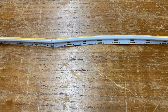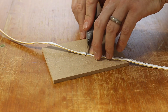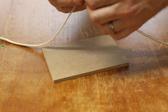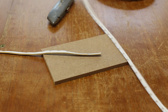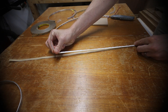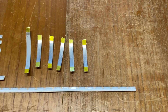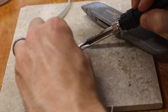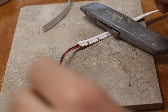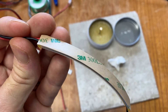There's no adhesive tape on the strip itself, so I ordered the same double-sided tape that LED strips usually use. The strips were then cut up and the tape applied. I got some two millimetre thick aluminium bar, cut it to the right length, and hammer-formed it into the right curve to fit within the central ring. A cap of tape was added to the end of each to prevent accidental shorts.